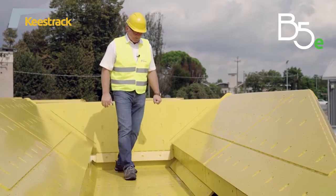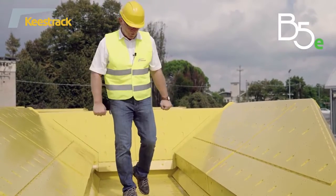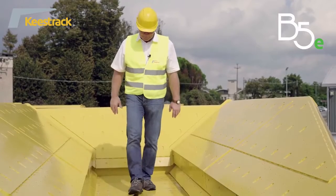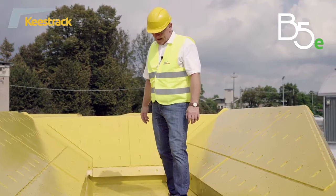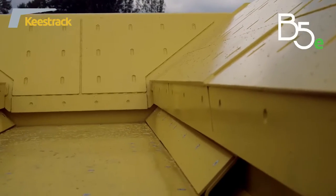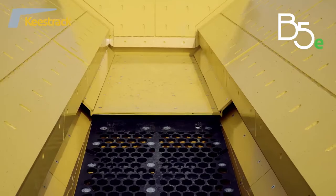Underneath the hopper we have the discharge vibrating feeder, which is feeding the material constantly to the jaw crusher. The length of the vibrating feeder is 2.3 meter by width 1 meter. Also the feeder is lined with bolted wear lining hardness Brinell 450. Then we come to the fully independent double deck scalper with a length also of 2.3 meter, a width of 1 meter. The top deck of the